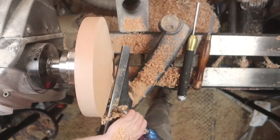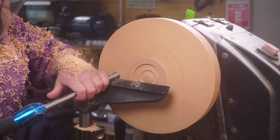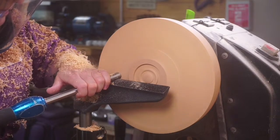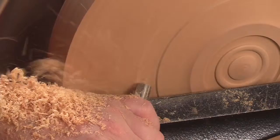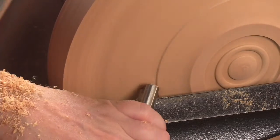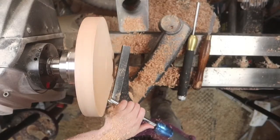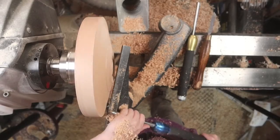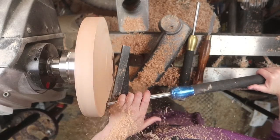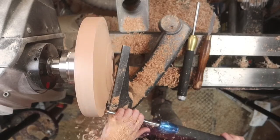So what I'm thinking of doing is, if we have an area of texture about there, and then we put our curve in, and we have another one at the top, might make that a little bit smaller. There we go. So I'm cutting in. Again, if you've got fingernail profile gouges for that, it will certainly help you make that a nicer cut. And then I'm going to start to shape this area further out, and possibly stop around there. Take that down a little bit more.